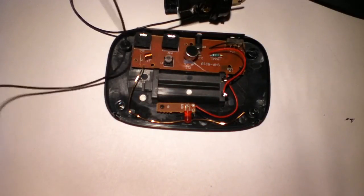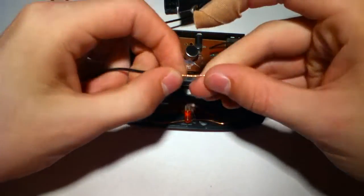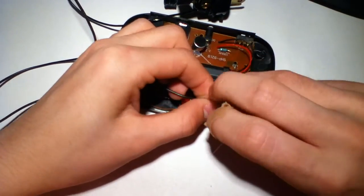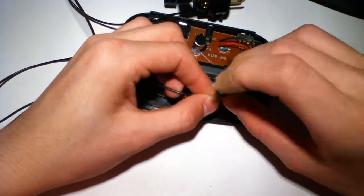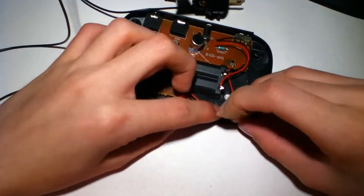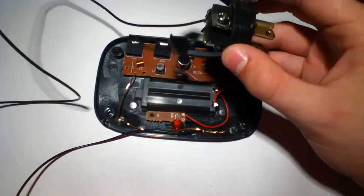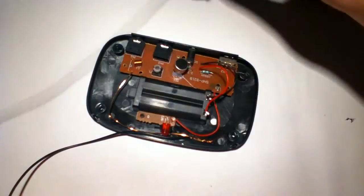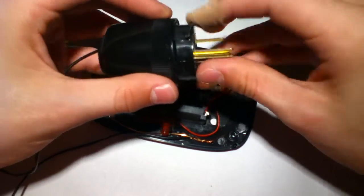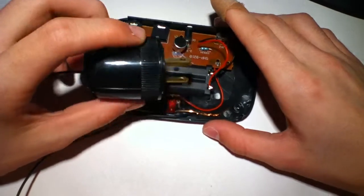So what you do is, if I feed this wire, strip out a good bit of the end, take the end of the antenna here, and I twist it around the antenna. And I put that back into the case. And that's it. So now all you've got to do is take the plug after you put the shielding back on. I can't tell you how many times when I was testing my capstone, I didn't put the shielding back on. It's not fun to have 120 volts AC running through your hand. It tickles, but it's not pleasant.